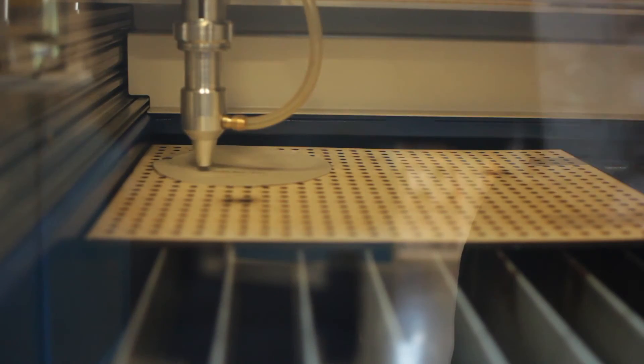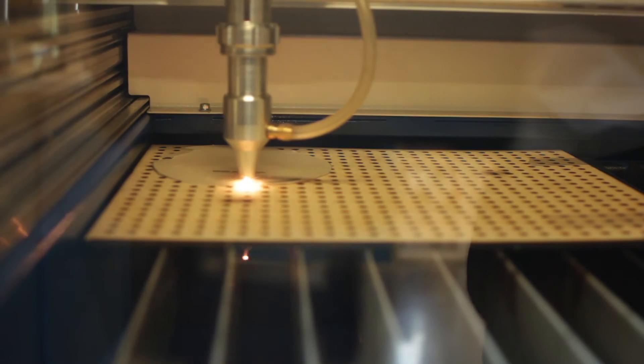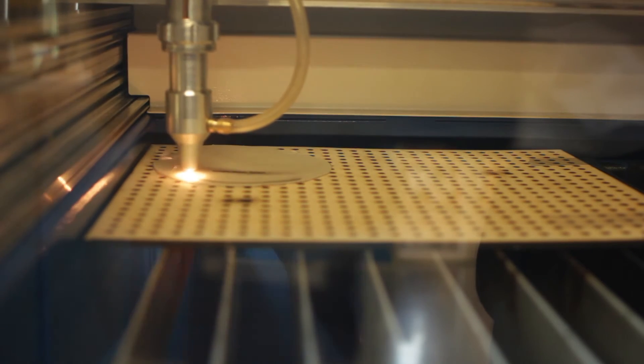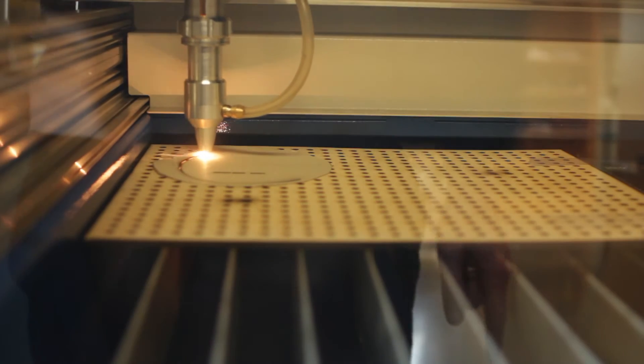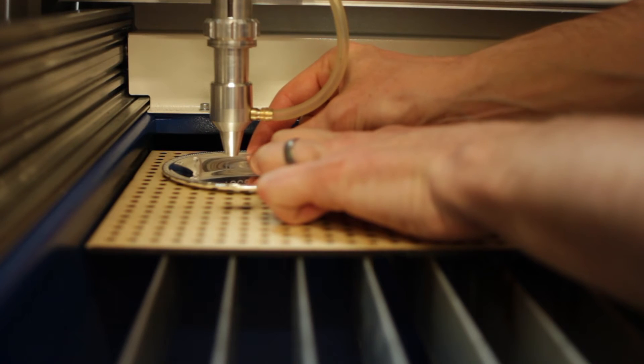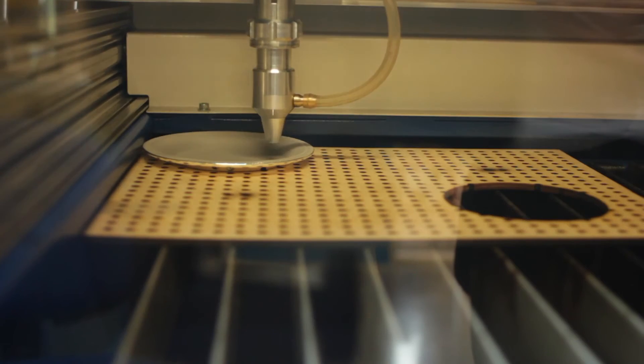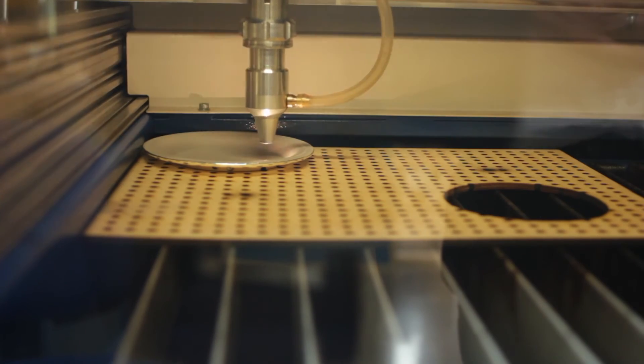This was the first effort, which ended up being a bit of a rastering process, so we learned the lesson and changed the lines over to vectors. In particular we used a vector font which is dedicated to CNC engraving. Here we are setting up the laser focus and then doing our first test run, which just about worked out.